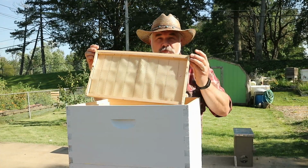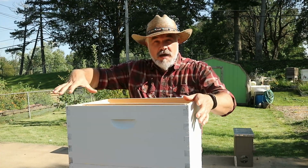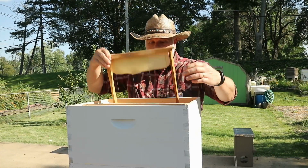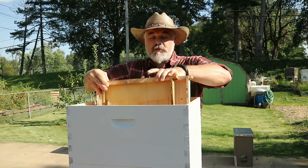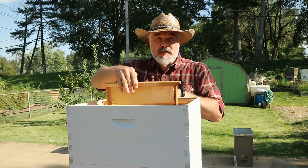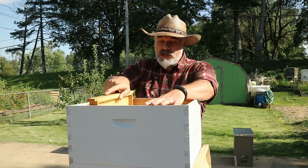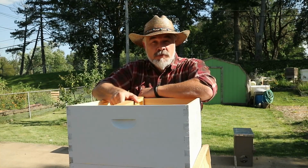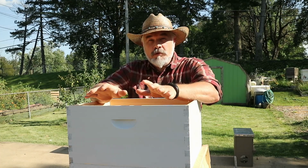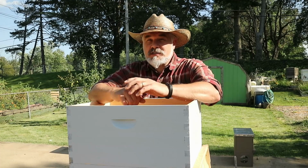As I mentioned, the Langstroth frame is 19 inches long and, as it should, fits perfectly lengthwise in a Langstroth box. A Layens frame is not that wide. You can see the difference pretty readily here. There's several inches difference between the two frames. And so obviously that frame is not going to hang on the frame rails in the Langstroth box. But the width of the Langstroth box is just slightly wider than the Layens frame, and we can use that to our advantage. Doing this conversion is very simple, requires very basic carpentry skills, and depending on how much customization you do, is completely reversible.